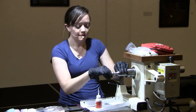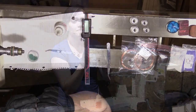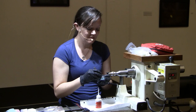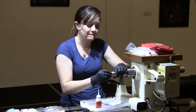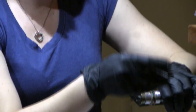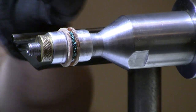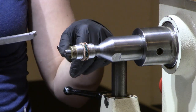After that step, I will turn it down and get it smooth to how this one is. I almost always have holes, so I'll get the tweezers, find stones that are about the same size and shape as the hole, place them, and crush them down really hard. Then I put just a teeny drop of CA glue to hold it in, and repeat that all the way around the ring until there are no more holes. Then I take my round tool - it's a negative rake so it doesn't take as much off and doesn't chip it badly - and get it smooth.